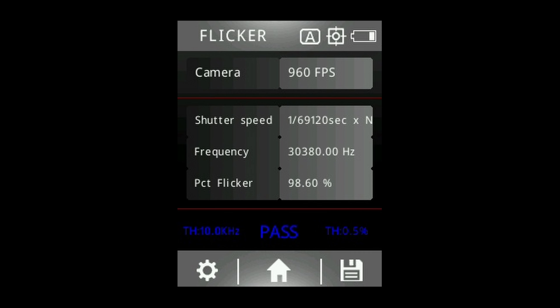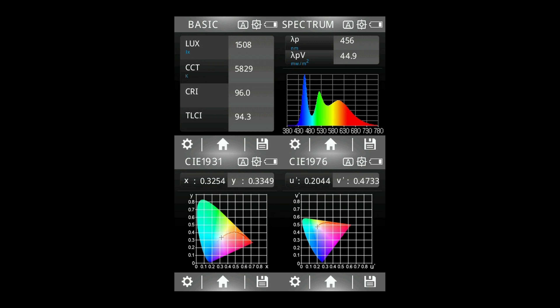I'm going to go ahead and measure the CRI and TLCI now with a UPRtek CV600 and get some real numbers. The frequency is configurable from 10 to 30 kHz so you never need to worry about flicker with this light. When measured from 1 meter away with the softbox and grid attached, we got 1500 lux, 96 CRI, and 94 TLCI, which are all excellent readings.